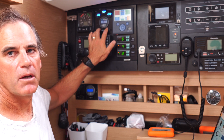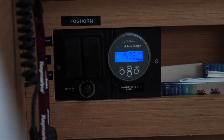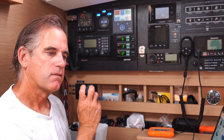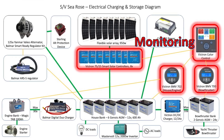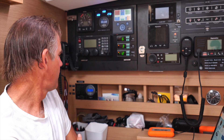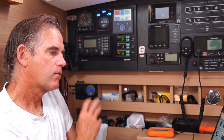So I've got one up here for the house bank. I also have one down here that I most recently added for the bow thruster bank, so it's monitoring amps in and amps out of the bow thruster bank. You could argue you'd want a third one since we have three banks on the boat. The engine starting bank is not as critical. The bow thruster bank, since it's also a 24-volt bank, I really wanted a way to monitor that separately. So I got a second Victron BMV — this is just the BMV 700. It doesn't have a second input to manage voltage from another battery bank; all I needed it to do was focus on the bow thruster bank.